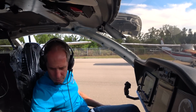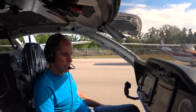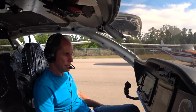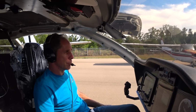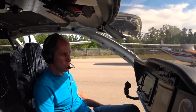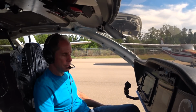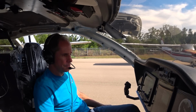It didn't take that much to bring the EGTs down to 1400 and have them stabilize, which I think is quite reasonable there. It's just the coolant here, just not enough air coming in to keep the radiator and ultimately the oil temp down. And I don't want to push it too hard. I don't have to on stuff like this.